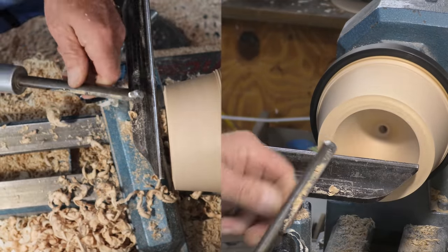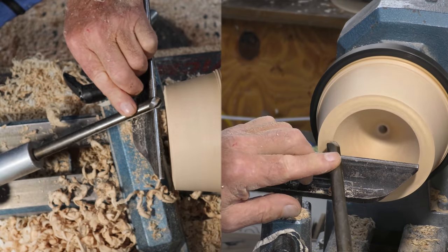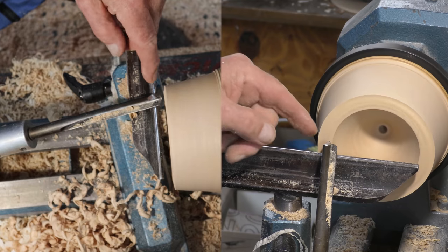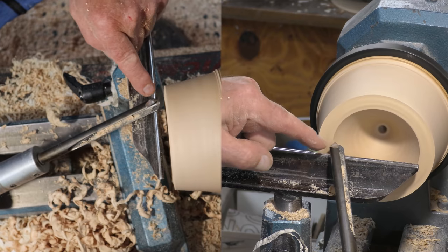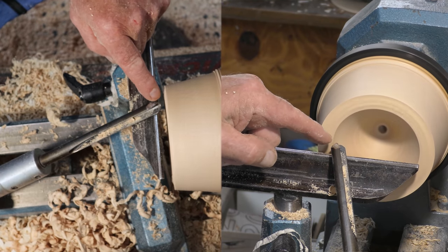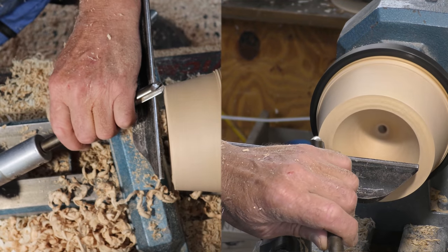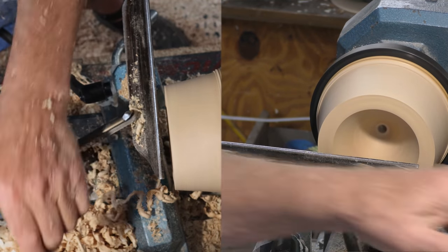So I put that down to lack of practice. What happened was that the tool wasn't right on its side. I could see a bit of the flute, and as I came in, the inner lip of the end of the hole just caught the left wing, and that's what caused it to run back a bit. Not a big disaster really.